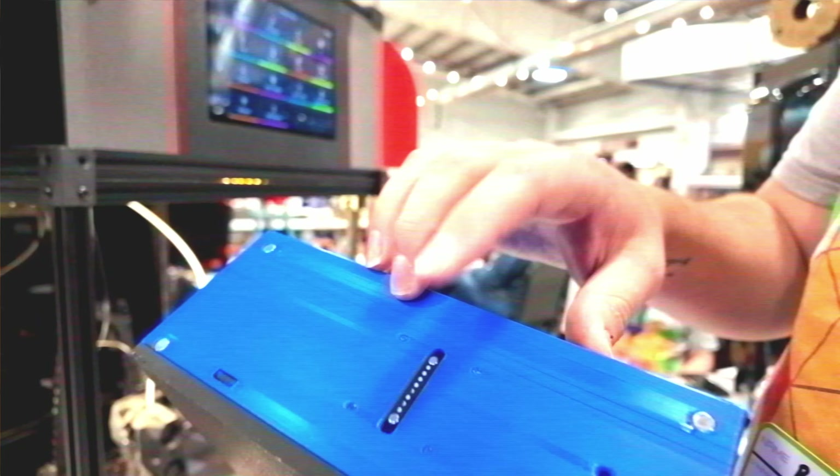I'm here with Robert from Armored Turtle, and they have a multi-filament feeder system attached to a Voron V2 — it's called the 8-Track. What we have is a modular automated filament changer. Each filament is in its own dry box. We call these cassettes. It works kind of like a thumper block for a carrot feeder. This is what feeds the filament to and from the toolhead.